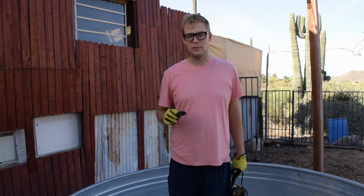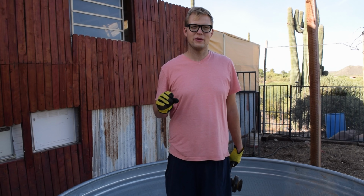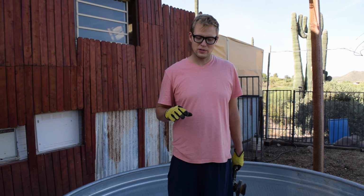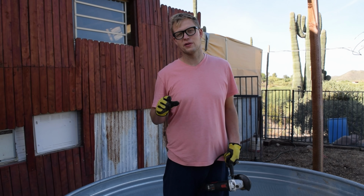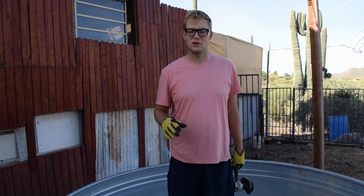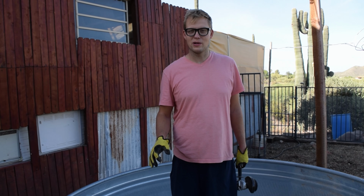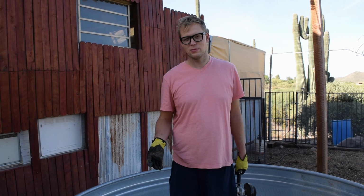After the wire brushing, we're going to use white vinegar all over the pool. The white vinegar etches the surface, and it cleans off all the oils and debris. And after you've done that vinegar wash, you don't want to even touch it with your skin, because that could leave an oily residue that the paint will have a hard time sticking to.